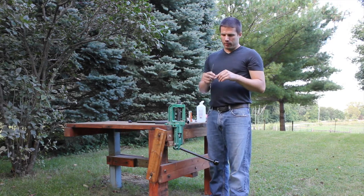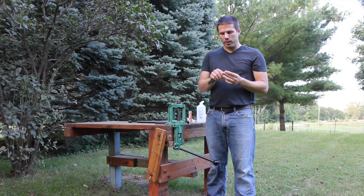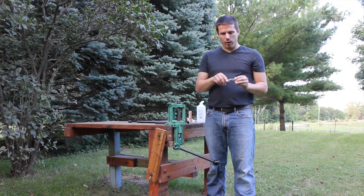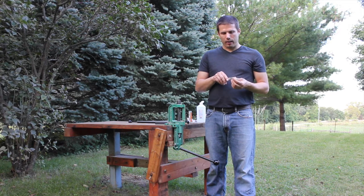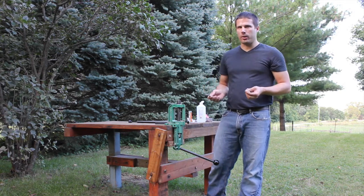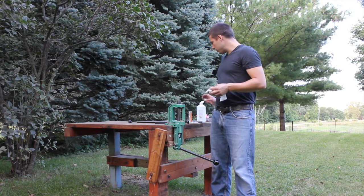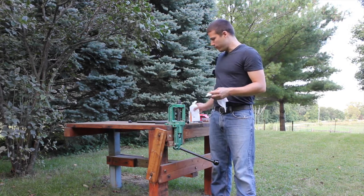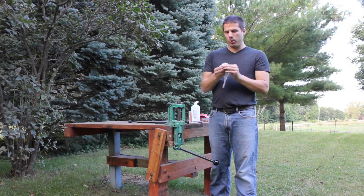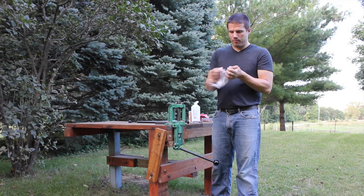Once I've reached that point, this step is optional, depending on your barrel and how anal you want to get, but I take the pocket knife and make a mark using the reference mark on the side of the bullet. I make a mark on a land. I do it to the same land every time. It doesn't matter which land, as long as you're consistent. I do that because the next step, I'm going to clean the sizing lube off of the bullet, and that takes away the permanent marker on the side of the bullet too. So if I want to index my bullet to the barrel, I need that permanent mark on the base.